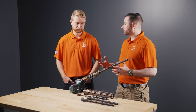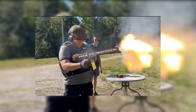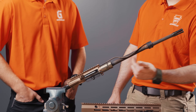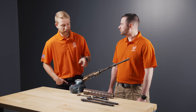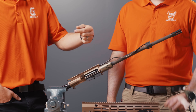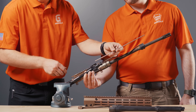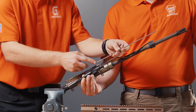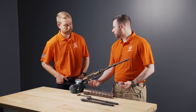So 901 rounds — we were very excited with that — but ultimately, Dean, why did this system fail? When you look at Ben's video you can see that the gas tube kind of coils up under the hand guard — a little droopy boy action going on. This is all from heat; the barrel is almost glowing hot at that point. What actually happened is the gas tube slides slightly out of the upper and the gas key can no longer index at the end of the gas tube. So as the gas tube drooped it stopped providing gas to the gas key, which stopped the bolt from cycling.